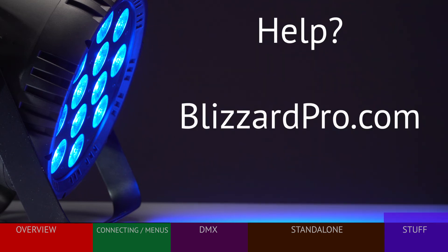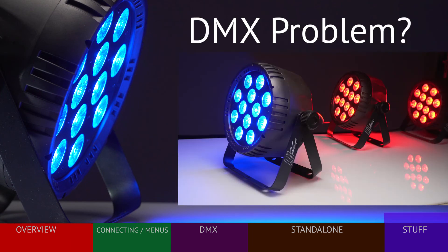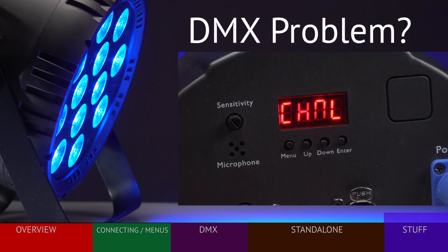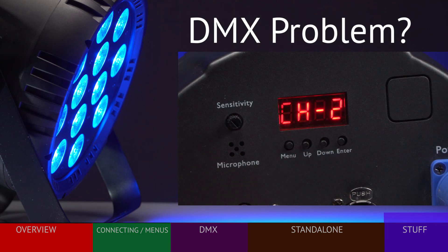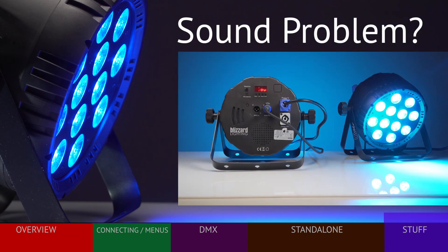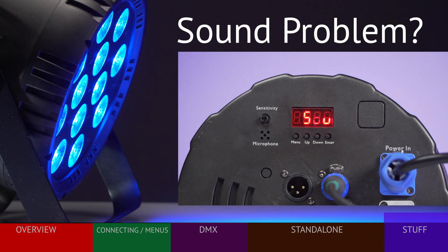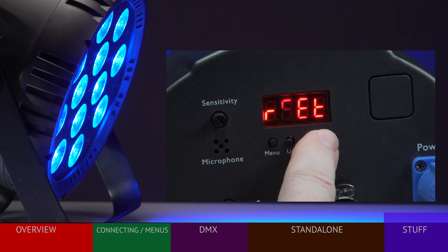If your fixture is not responding properly, refer to the manual or contact the manufacturer for troubleshooting help. Make sure your fixture is set to the correct DMX address. If one fixture is showing a wrong color, check the channel setting to make sure it is set properly — either 1 or 2. If DMX signal is coming in, the indicator light will be on. If sound mode is not working, make sure the fixture is set to sound; if it still does not work, try adjusting the sensitivity knob or move the fixture closer to a speaker. And remember, if you're not sure who was using it last, just hit reset and start over.